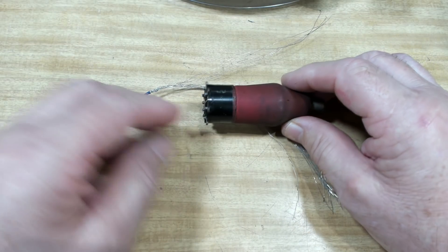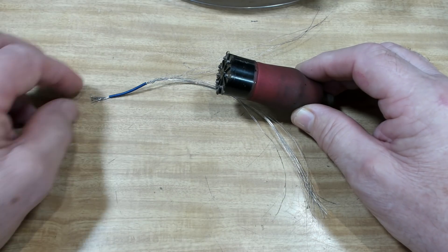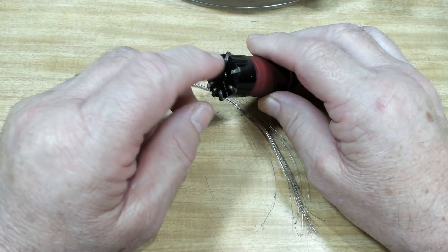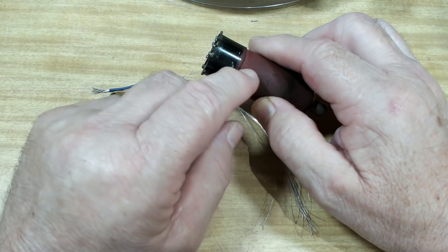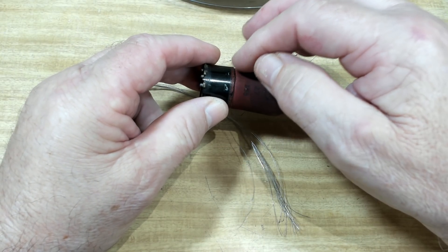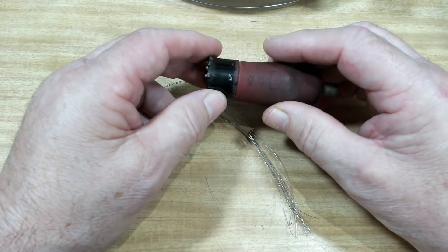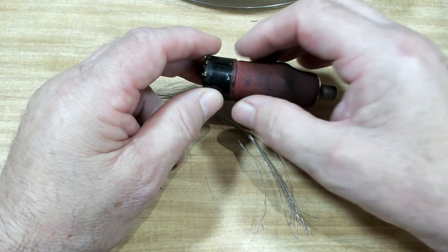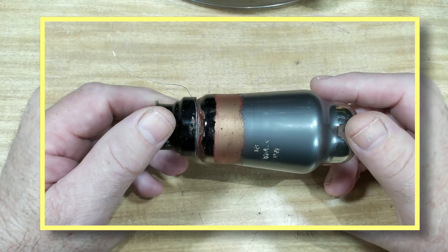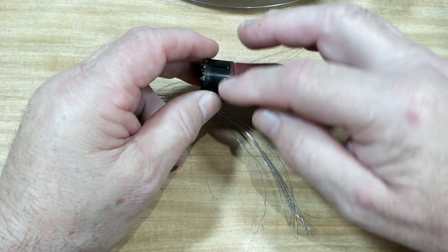I'll show you the method improvements I came up with, using an old tube as an example. The wire I used, I cut longer than last time — last time was too short. I also fed it in from this way rather than back the other way, which was easier. I left a bit of insulation on the end so I couldn't pull it through. I added a bit of solder to each lug — that seems to melt it much quicker. I marked pin number one on the body of the valve with masking tape. When wiring onto the original bits of wire, I put a bit of flux on and that helped tremendously. When gluing it, I put the glue on the glass rather than in the base, so it didn't get all over the wire. I pushed it together, held it, and wiped off the excess with acetone — that made a much neater join. The acetone also took the red paint off and left the gold shield underneath, saving me having to scrape off bits of red paint.